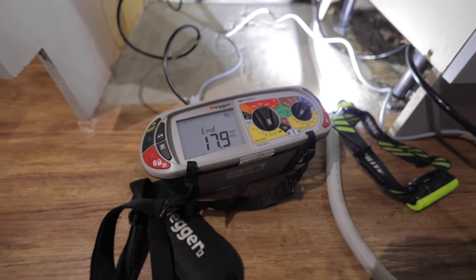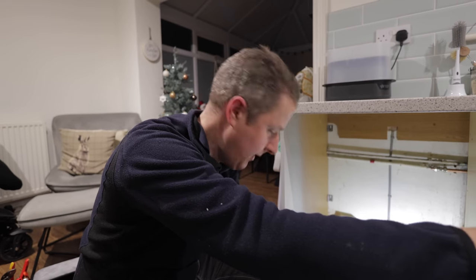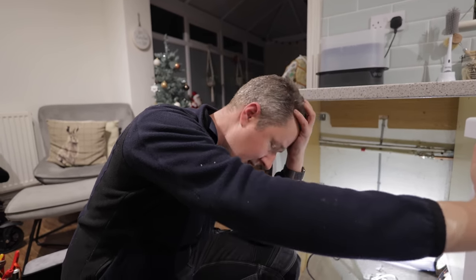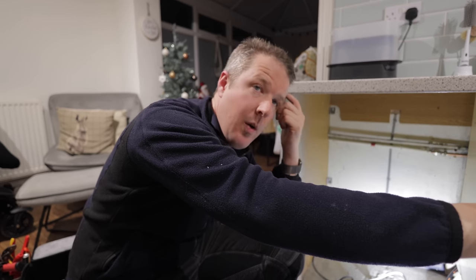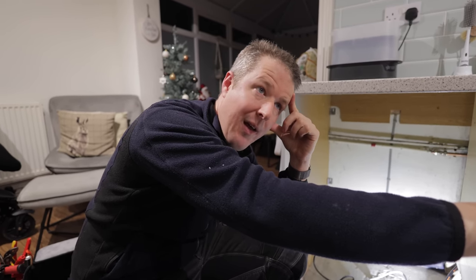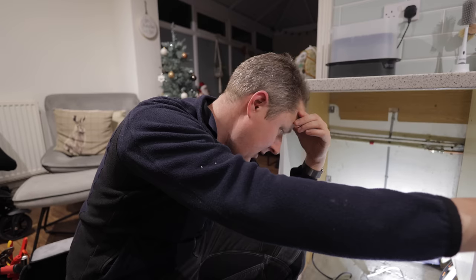That is all absolutely fine. So as an electrician, I've done all my tests that are required. I'm thinking, great, everything's safe. It all trips out properly. I'm safe to leave the installation. But the question is still there in my mind, why was there power between line and earth and neutral and earth when I had the circuit turned off? Has that now been solved or is it still an issue?